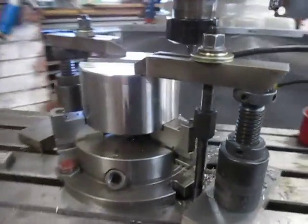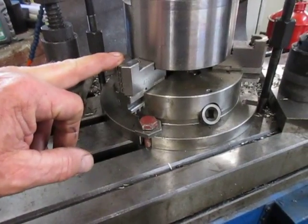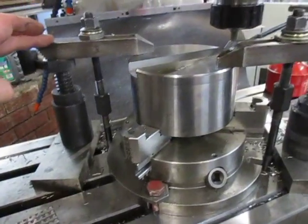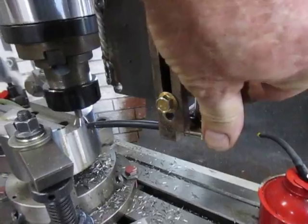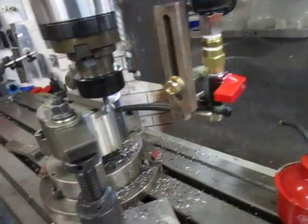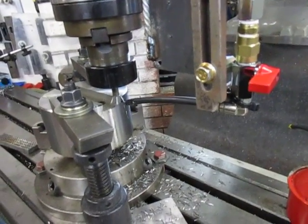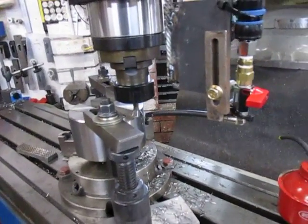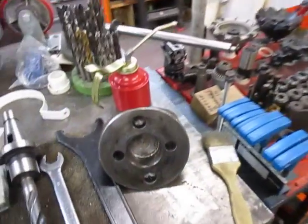For the setup here — when drilling for the other side I had it on this chuck, and when I came to machine it, because of the heavy load I added a couple of straps to give it more rigidity. I knocked up a Heath Robinson affair to produce some air during the heavy cutting. Now I'll make a proper one with a needle valve that I can control much better and with a very fine nozzle. I much prefer air cooling over fluid coolant — if you can get the chips away with a little bit of air on the cutter, it's far better than fluid.